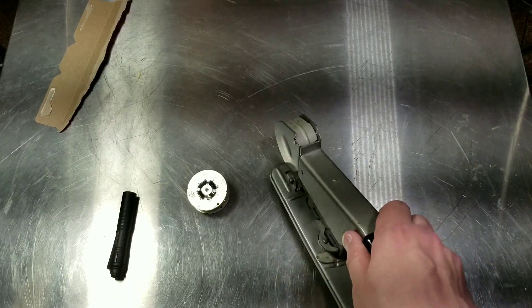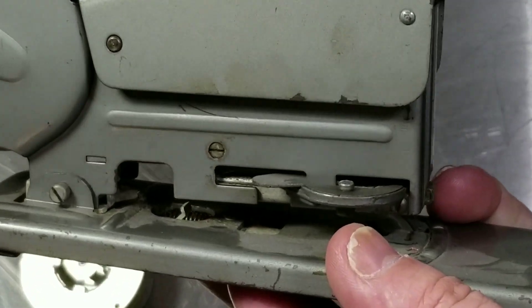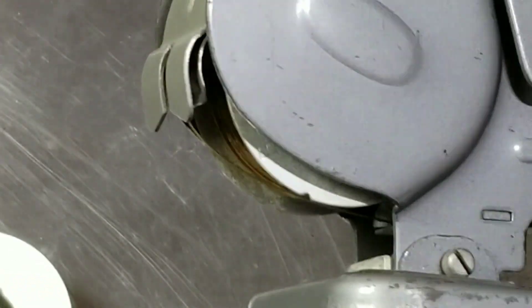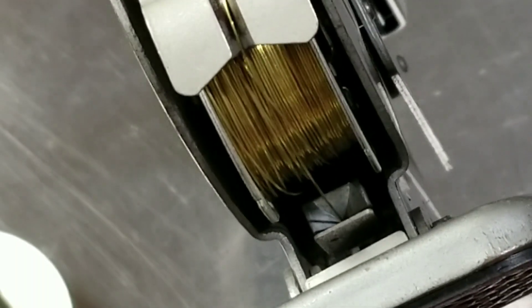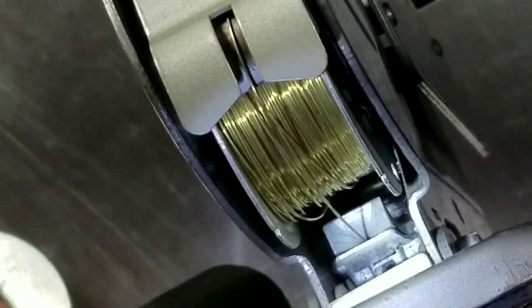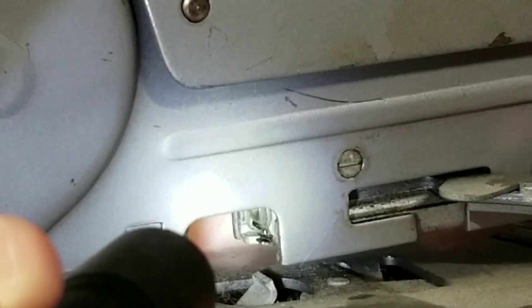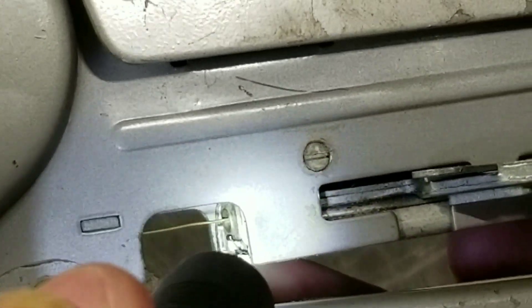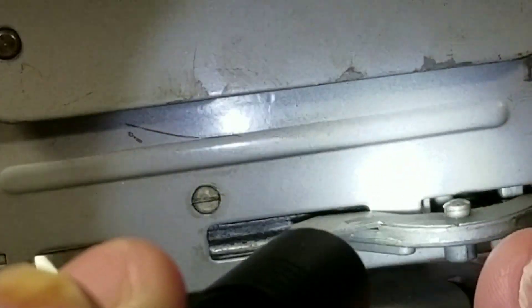Although it's really well built — look at a little zoom in here — so how it works: you have a coil of wire on a spool in the back, and it goes through a metering guide with a little gap and a little clip that's actually the ratchet. It goes through a feeder orifice that also contains the ratchet mechanism, and it goes around this track through to the front of the stapler.